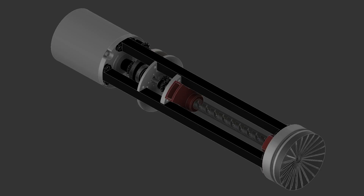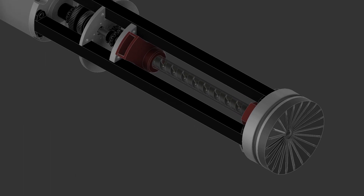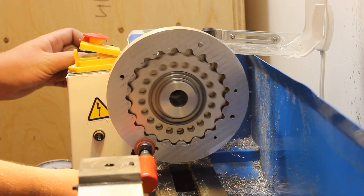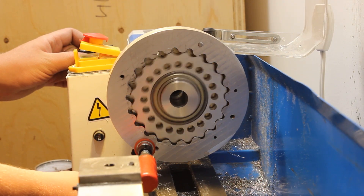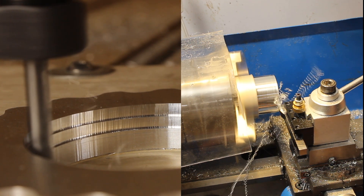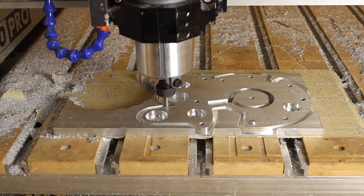I'm now building a rock drill to test my future robot's drilling mechanism. It is designed with a gearbox-driven auger to move material away from the drilling face. The front face of this drill is a cycloidal drive. I machined the cycloidal drive out of aluminum on my CNC and its eccentric shaft on my lathe. This was my first major machining project. I'm now machining plates for the rock drill's gearbox.